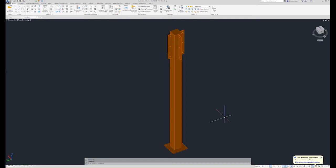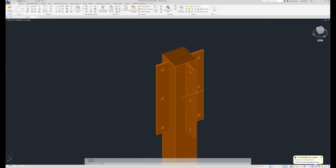So that being said, again, I'm going to look at this column and decide how, as a fabricator, or put myself in the place of a fabricator, say how would they put this together. In our shop, again, first thing we always do, weld on end caps. Again, so we can easily rotate the tube, get to all the positions of welding easily, grind and finish the top cap easily because we can rotate it.